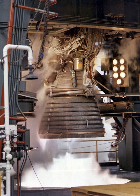The propellant feed system required a number of valves to control engine operation by changing propellant flow through the engine's components. The main fuel valve was a butterfly-type valve, spring-loaded to the closed position, pneumatically operated to the open position, and pneumatically assisted to the closed position. It was mounted between the fuel high-pressure duct from the fuel turbopump and the fuel inlet manifold of the thrust chamber assembly, controlling the flow of fuel to the thrust chamber. Pressure from the ignition stage control valve opened the valve during engine start, allowing fuel to flow to the fuel inlet manifold.